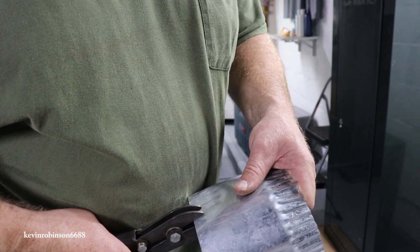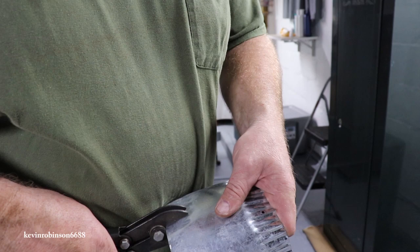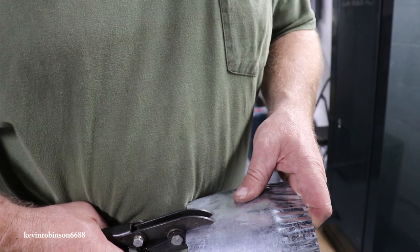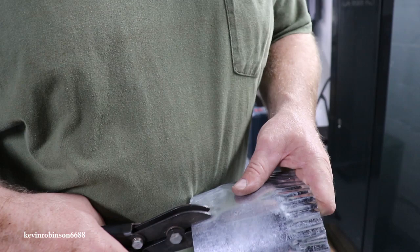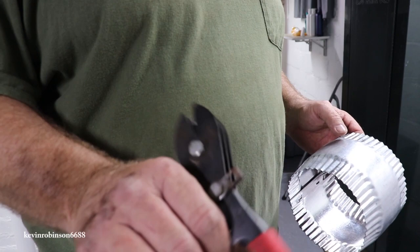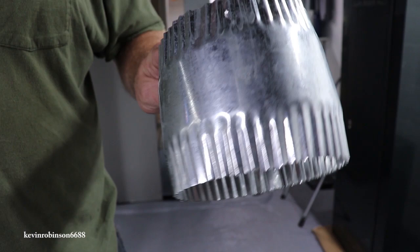And if you don't have that crimped, then guess what? We couldn't use this piece of pipe. So, see how that crimp is? We know we're going to get that right up in that pipe when we get this all done. Takes a little bit of time to work around it, but I'd rather spend a little time than money. So that's two times I used this tool and saved my butt. That's a cool tool. I'm telling you, you guys will like this tool. If you have to work with any kind of ductwork or chimney pipe or something like that, tool works great.